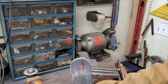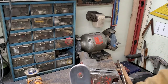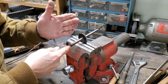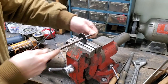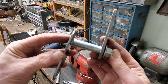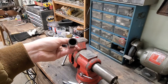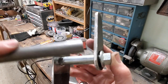I'm gonna make a square hole out of this so this will fit in by using my square file and a lot of elbow grease. It's kind of a process of going down this way, up that way, this way, that way. Cut my little square in, it'll now fit in there, and now it's just a matter of making my little sleeve. I'm using some three-quarter inch tubing, pretty thick wall — 50 wall — but I'm boring it out with a 15 millimeter drill bit so I could use my little 15 millimeter stub ends there.